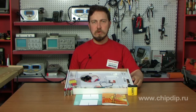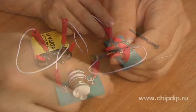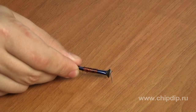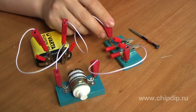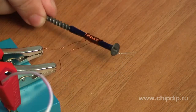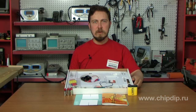Now let's put together a simple electromagnet. We need to wind 100 coils of fine wire on a screw and put the circuit together according to the description. If we bring the screw close to any iron object before powering it, we will see that it does not interact with it. We switch on the electric current. The iron core inside the spool becomes a magnet that attracts the object. We got an electromagnet. This effect is widely used in different equipment — for lifting scrap iron as well as in electrical appliances for closing simple relay contacts.